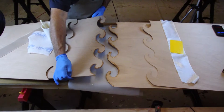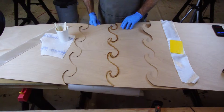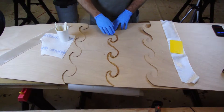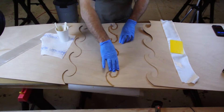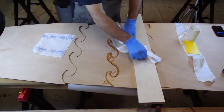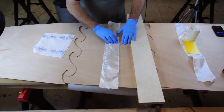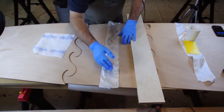Once you complete both sides of the scarf, you can slide them over and fasten them by pressing them together, or if needed, use a mallet and a small wood block to tap them flush. Now lay one of the long pieces of fiberglass tape on the scarf joint. Place the fiberglass so that it covers the joint entirely.